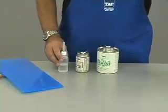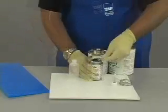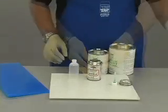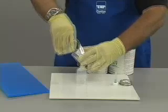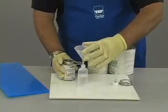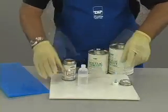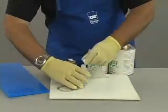Acrylic cement is available in various quantities. It is dispensed with what we call a hypoapplicator. Pour the acrylic cement into the applicator with a funnel. Do not fill it more than 3/4 full. Since this is a chemical solvent, handle it safely using rubber gloves where skin contact may be possible, as well as safety glasses.